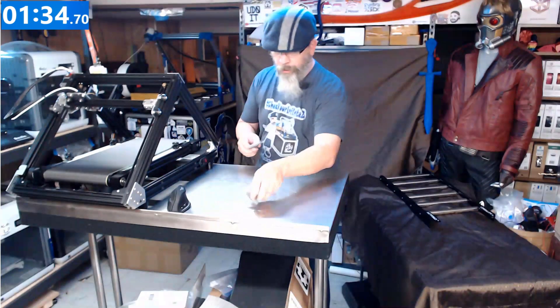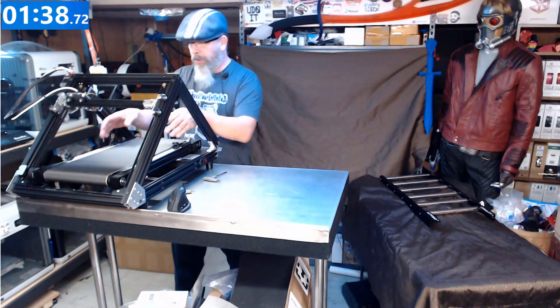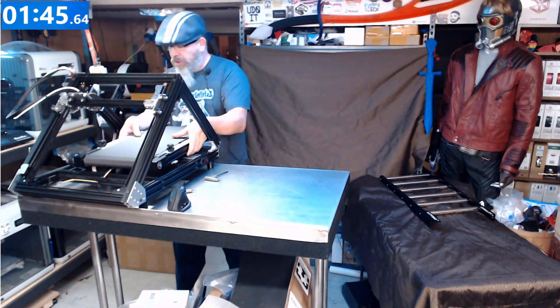And that's all four screws. With those four screws removed and the power and the stepper disconnected, you can just lift out the whole assembly — assuming your cable doesn't snag on something.